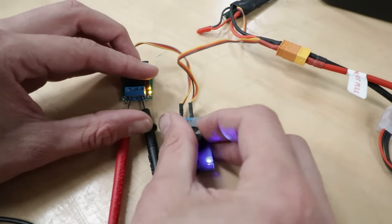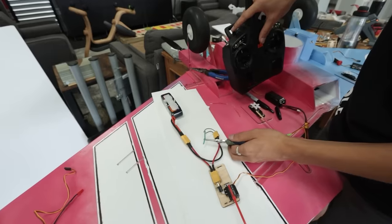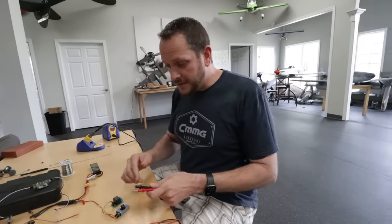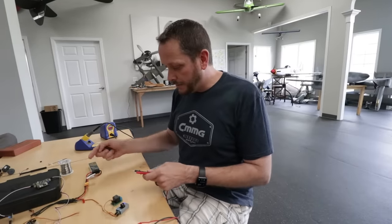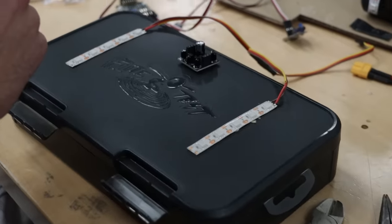So that's perfect. And in the past, you've seen us use two contacts with an XT60 and then a servo coming down and making that current. It's far too unreliable, especially when we're talking about something that we want to explode. We're going to use this as a remote to be able to put battery voltage to our remote igniter to ultimately ignite the mortar. So I got to make the circuit.